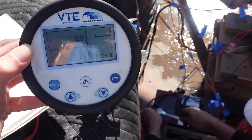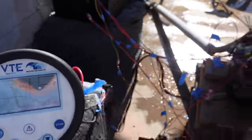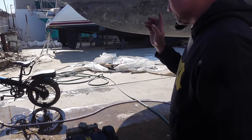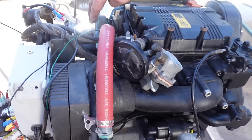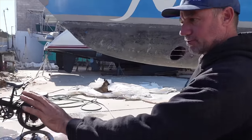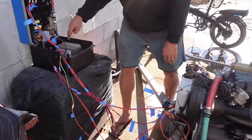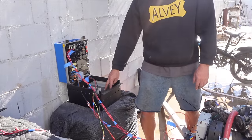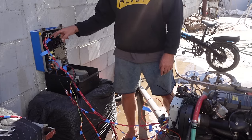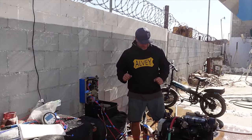Alright, that's a start. Let's start — the display's working. I've just put some fuel in the drum here. Pump up our fuel — these are self-bleeding. So fuel, water, power. I've rigged up a tap, a hose tap. There's no impeller in here so this will suck normally from the sea intake, but now the water will just flow through and keep it cool. Got the inverter box open so I can see what's going on and it'll make testing easier. These are our three that come out of the generator — three phase — and then it'll convert it all down to here, which should be 220 to 240, around 230 volt. Then we're going to check up here — that's the generator coming in. As long as they're all the same we should be right. I'm going to test that, just make sure nothing starts smoking or arcing or funking out.